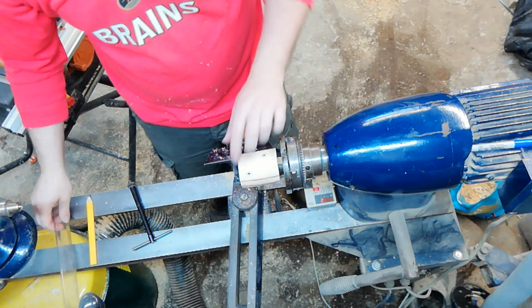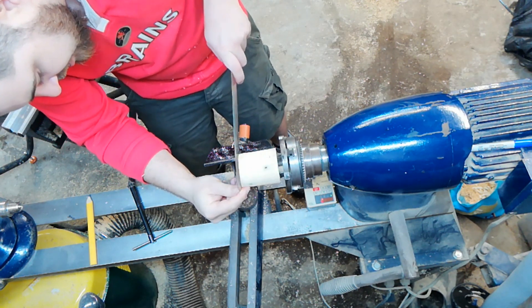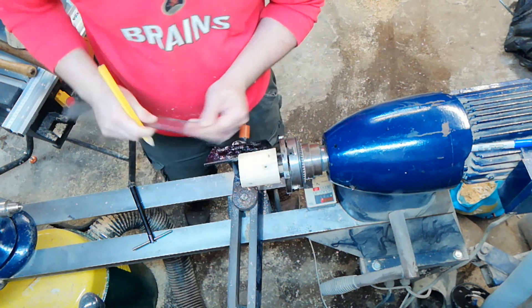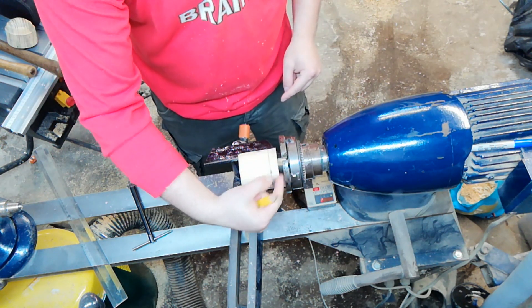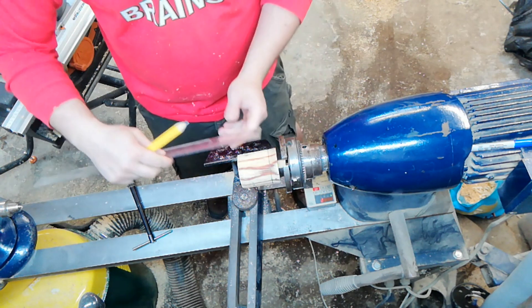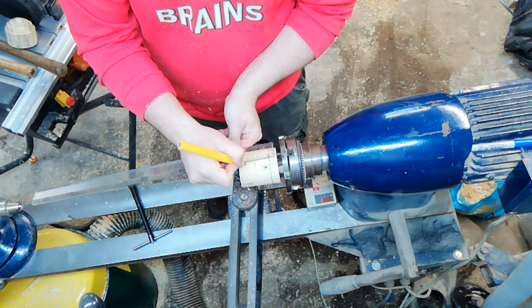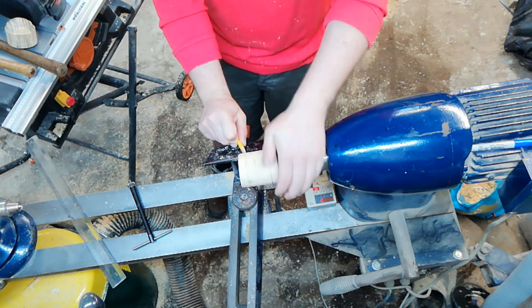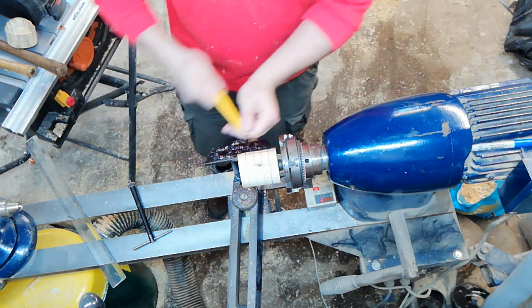Turn this into the round, then measure the diameter of the block — in this case it is 60mm across the center. We're going to measure back 60mm and draw a line all the way around. This gives us a little bit of space where the chuck is holding onto the spigot, and we're going to need that space to round the edge over later on. Next, we measure the halfway point — 30mm — and the halfway points in between at 15mm each, scoring those lines all the way around. That's going to help us when we come to doing our curves.